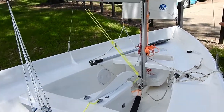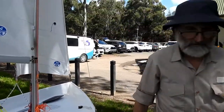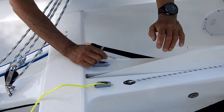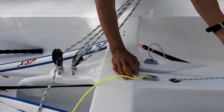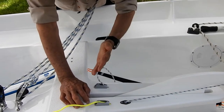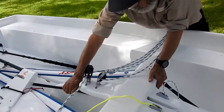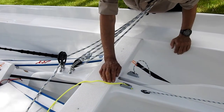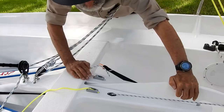The last thing as far as in the boat goes is the centerboard. The centerboard has a rope that pulls it up out of the water, and it also has a rubber shock cord that pulls this rope, which pulls it down. So we can adjust the position of the centerboard. Most of the time we'd want it to go all the way down. We haven't quite got the tension in the bungee pulling the board down correct yet, but when you get in the water you might have to grab that and pull it down once you get into deep enough water. When you need to get it up again, you may have to push it a little bit and pull this and lock it in so it holds the board up.